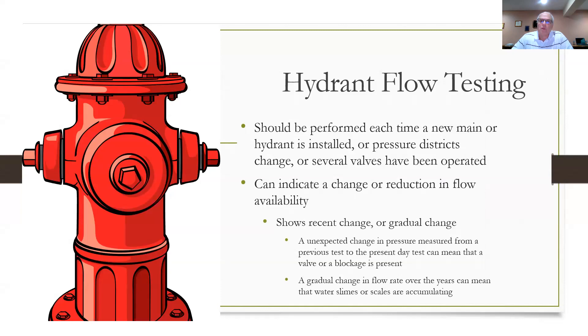When you do this fire hydrant flow test, there are certain times that you should plan on doing it. For example, if you put in a new water main with a new hydrant, you want to know the capability of that hydrant and that part of the system. Or perhaps when you change pressure districts in your system, you want to know the difference in firefighting capability. Or if you've had to do work on a water main break, a leak, or done some other work where you've had to move or open or close several valves. Sometimes we all make the mistake of leaving a valve open when it should be closed, or vice versa. This test will tell you if you've done that, or at least can help you to find out.